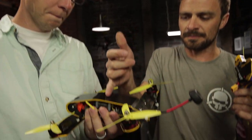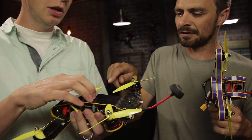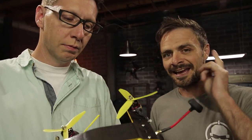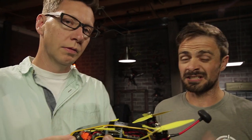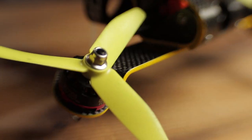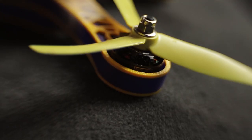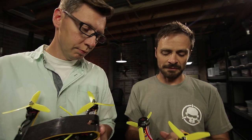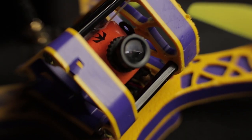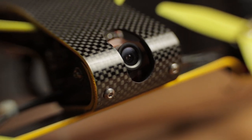The gear is the same in both, right? Yeah, exactly. The only difference is this one has got a KISS flight controller and this one's got a Betaflight board. This one has tilted motors - at the time KISS didn't actually support tilted motor functions, though it's being introduced now. Everything else is the same: HQ 5x4x3 blades, Emax RS2205 2300kV motors, KISS 24 amp ESCs, the Tramp VTX, and a Runcam Swift with a 2.8mm lens.